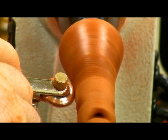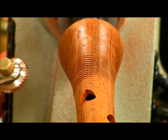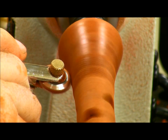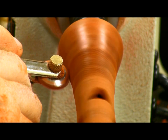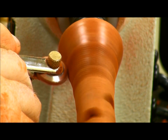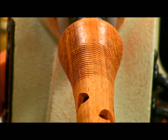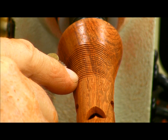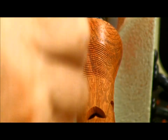If you decided you wanted to come lower with your pattern, can you start and go either direction? Yeah. I'm going to back up the other direction. If you approach the piece slowly with the tool it'll find the groove — you need it straight on first and gently let it go in there. Depending on the diameter, sometimes you'll get a diameter where the spacing won't work just right, and when it comes around to the next one it will mess it up. If you just cut that off and change the diameter a little bit it'll probably go back to work.